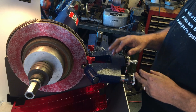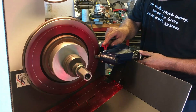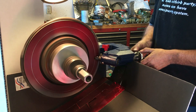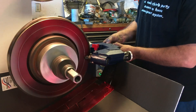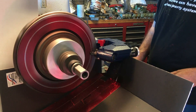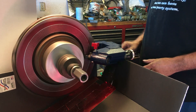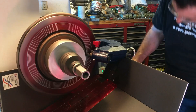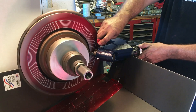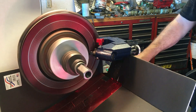With this setup it's just too easy. The red on here is just a die coat so that the cut will appear nicer in the video — you don't need this to actually do nice cuts like this. So let's get rolling. I want to do a finished cut, so I turn the speed down to about one, adjust my cut depth to about three, and off we go.